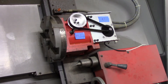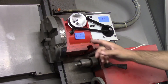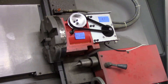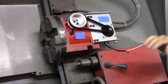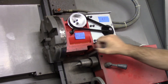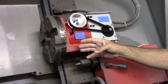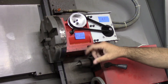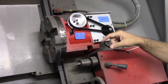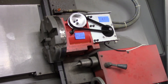Got one more tool change here. I did the gearing — the ratio is all correct — because it is resting on the pawl. When cutting, the tool pressure is on the pawl; that's how this thing works. There's a very large spring-loaded pin that engages the pocket in the turret. There's a pocket and a ramp so the turret can rotate unidirectionally: it comes out of the ramp, drops into another pocket, then comes back and pushes against the pocket.